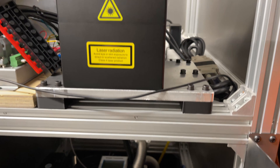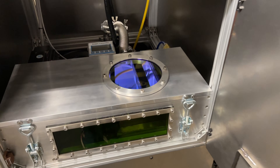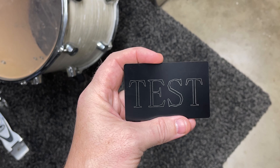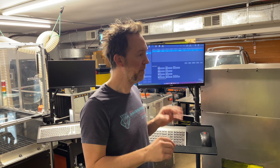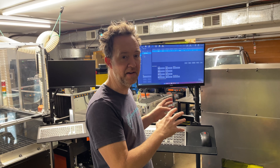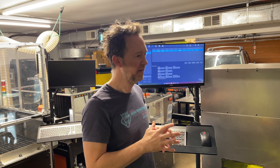You can see I've got it mounted on these spacers now. I'm going to put this all back together, do another engraving test and confirm that we're now in focus. I think we're much closer to being in focus now. I also wanted to respond to a popular comment that my testing procedure is very inefficient — I totally agree. I want to be doing multiple pieces with different parameters at once, but I've dug around in the software everywhere and cannot find a way to assign different parameter types to different models. So I guess for now we just have to take the slow approach.